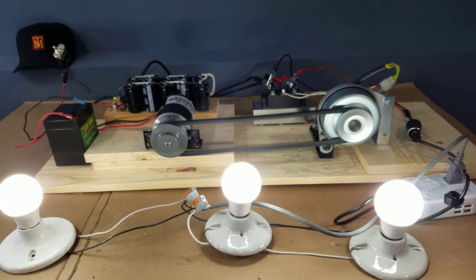Here I have homemade welding cable connections. We're gonna use the welding cables and make a few sparks. These supercapacitors do not have enough charge for a welding project. We are just gonna test to see how much amperage they can push out. And wow, they push out 209.3 amps! And the juice runs out quickly without the alternator recharging the supercapacitors.